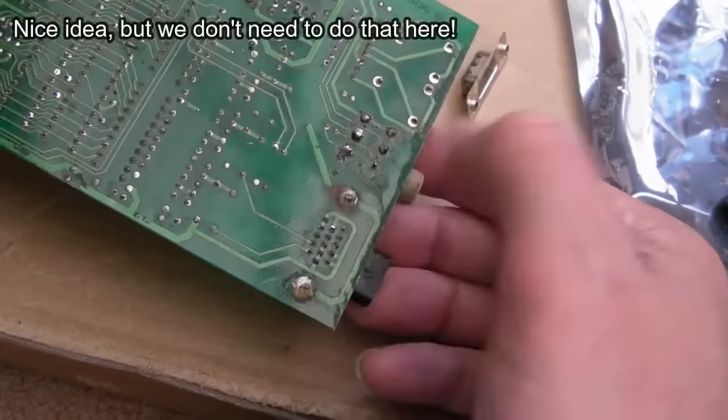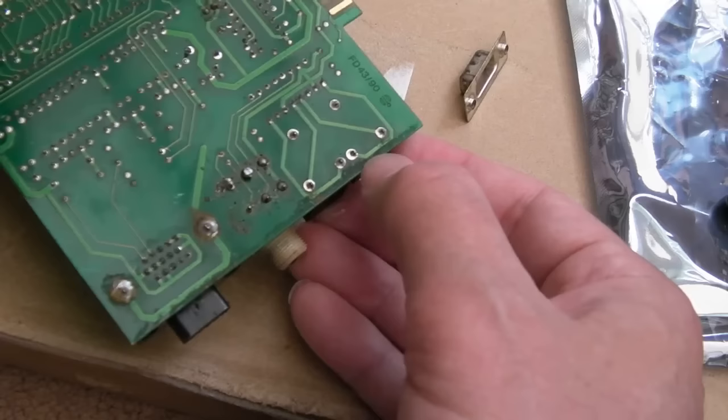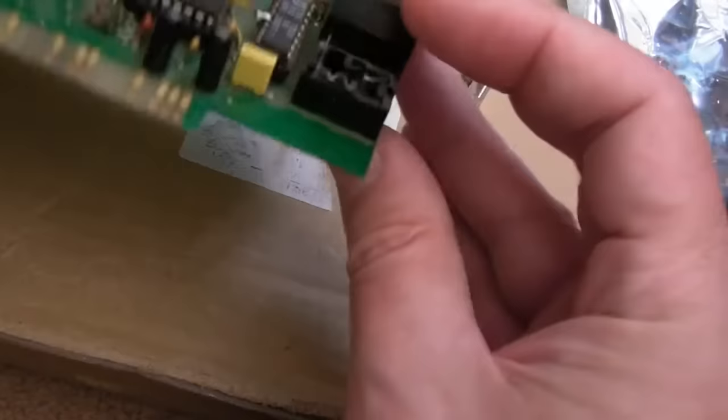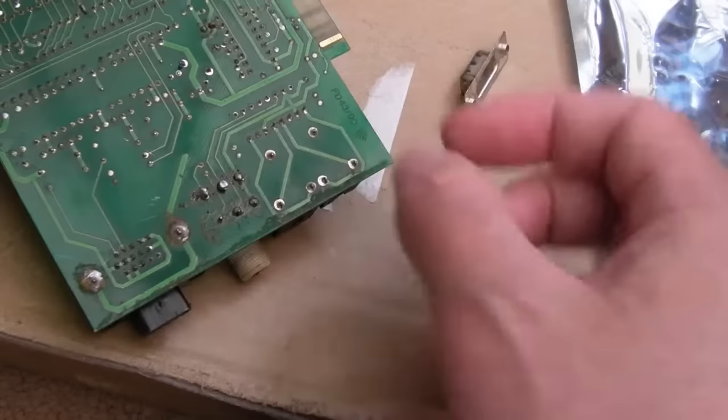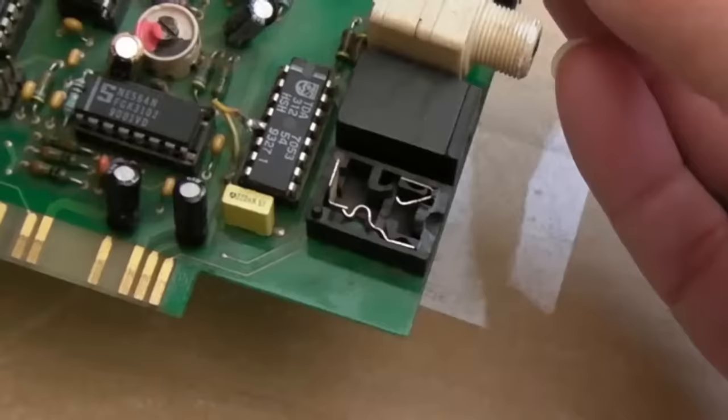What we can do is drill holes through the board, epoxy it on, and stick some wires to map it. That might be the answer with the jacks as well — we may not be able to source a replacement. I'd check with Tom and say we can't get a replacement, but I can glue new connectors on after drilling one or two additional holes to accommodate the different footprint. Finding something with this three-pin mono jack footprint is going to be tricky. And if this was audio, why is it not stereo?